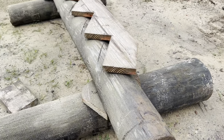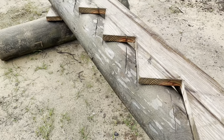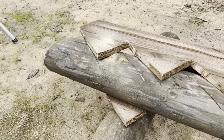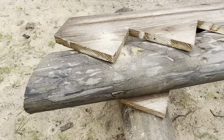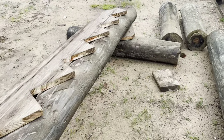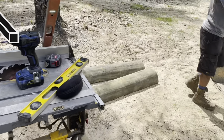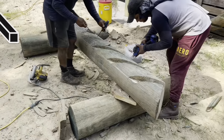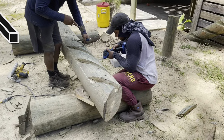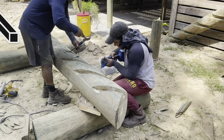I've got my gauge set out from the stairs here, from the steps. I've got them pre-scribed with a skill saw blade. I'm going to take the stringers off now and cut it in about two inches. I like to have about two inches wide and two inches deep. We've got our treads split in half with the chainsaw, and we're going to go ahead and get those installed on our stringers. We're getting the stringers notched out right now as well with the multi-purpose tool, chisel, and a hammer. Take a skill saw, do a couple cuts, and knock the rest of it out.